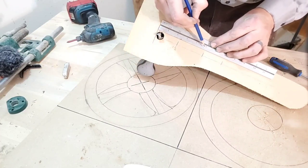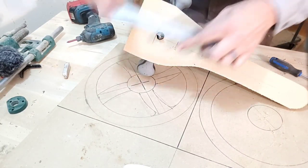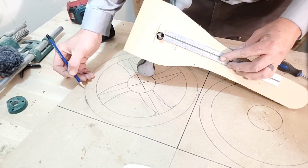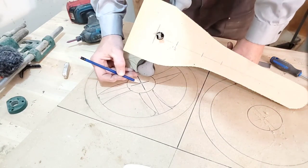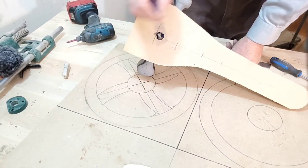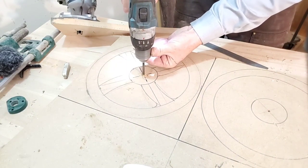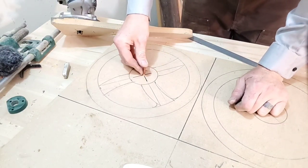I've got a mark on this side and that would be five inches over here. Easy for the outside — it's six and a quarter for the outside wheel. Butt it up against the outside, because remember we're cutting on the outside of the wheel here — it'll be six and a quarter. Now we find a pin that's going to fit in there, tap it in to stay, then drill a hole just slightly bigger than that pin size and it will pivot all the way around. Conveniently, a MIG tip is a quarter inch, so that's what I'm using today.